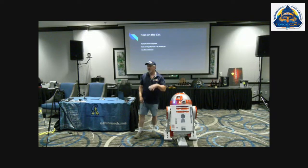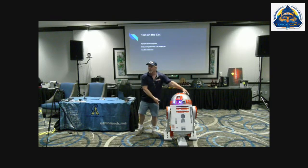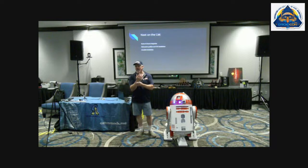For the ankles, it's a single motor in each ankle, and it's got a portion of a gear. If you think of the gear as a circle, it's using just 6 or 8 teeth of the gear on a lever, which then goes down. This is hard to imagine if you can't see it in front of you. I really should have brought some examples, but I was almost over limit as it was. The gear is affixed to the foot at an angle, just half of the distance we need to go. So as the motor in the leg rotates its gear, it's walking along this little bit of gear that's sticking out at an angle, just up to vertical and then just down.